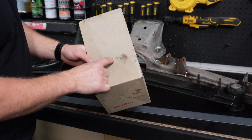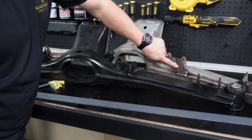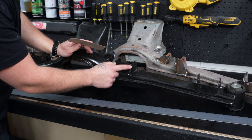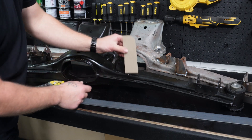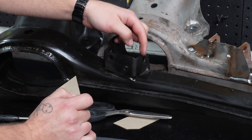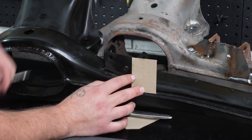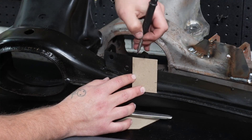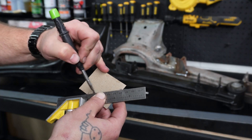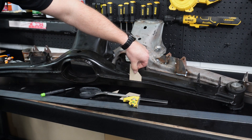I've got a box and I'm going to cut it into 50mm strips so I can transfer it onto the 50mm plate easily. Good enough, that's all you need. You can see we've got this plate over here which is just running down the side. We are going to need to grind back a little bit of the weld here, and we'll obviously clean up all of the paint before we weld. We go across at the top and cut that. There's a fold mark where they've bent this piece of metal. We're going to line this plate up with that — that's where we're going to be welding on. We mark the top and draw a line, and there we go. First template — it's as simple as that.